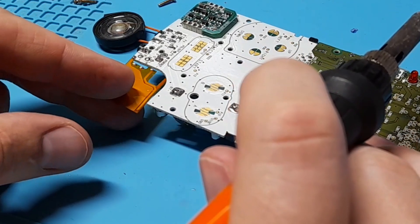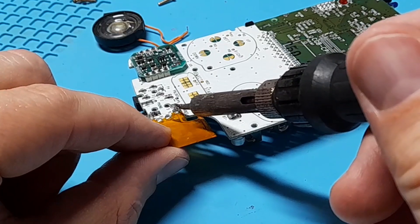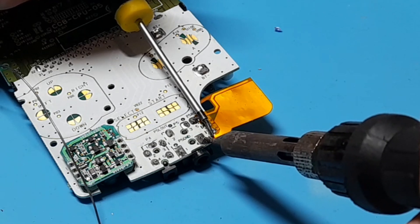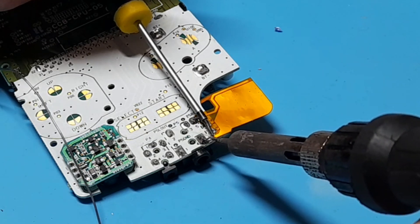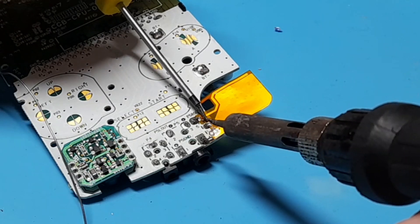The amp gets soldered to both sides of the board. The long skinny part is going to be on the back of the board, and the four points here are going to be those points that we pre-tinned already. With the points lined up, you're just going to drag solder from one point to the other to merge them. I found using a little screwdriver or pliers to push down on the ribbon while soldering made it way easier.